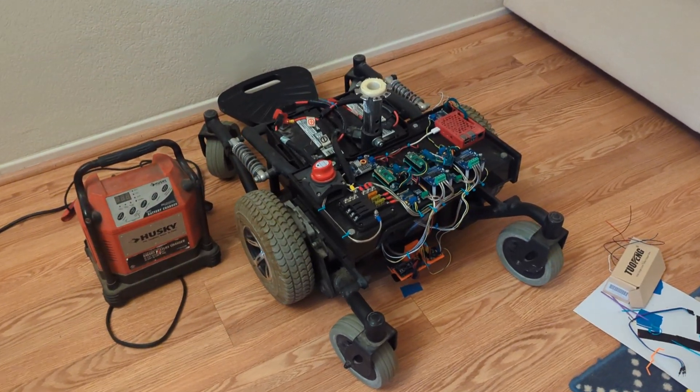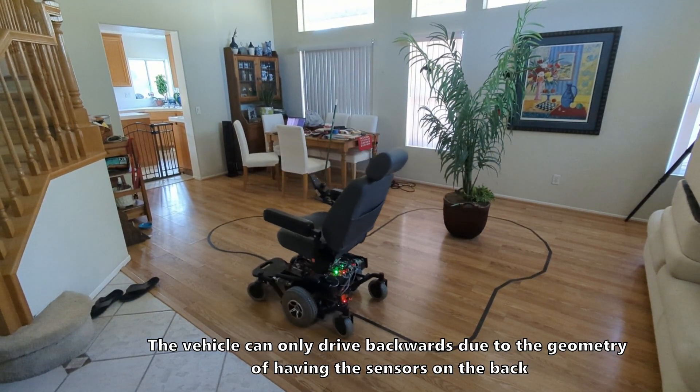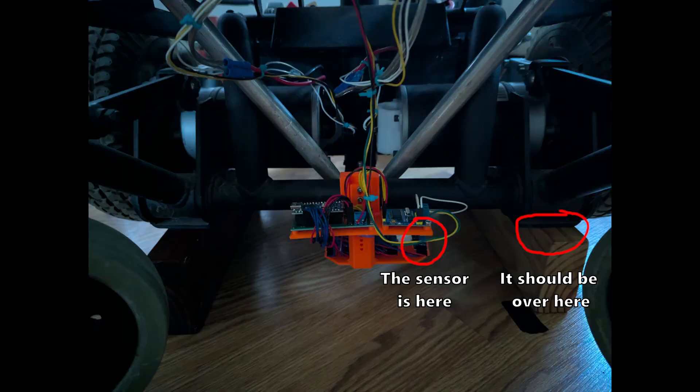The first iteration of the sensor block that I built had six sensors in a line across the back of the vehicle. Obviously, that's not the three sensors at the front I just mentioned — I built this before having the algorithm fully fleshed out, as part of figuring out how the algorithm would work. The first major flaw is that the sensors are all in the back of the vehicle, so the vehicle isn't able to drive forward with just these sensors. Additionally, for a vehicle this large and heavy, the sensors are too close together and the momentum of the vehicle means it cannot react fast enough for these minor disturbances. The final issue is that the location tracking sensor — the one that measures the tick marks — is way too close to the center of the vehicle, so it would occasionally read the main ride profile line as a tick mark because it veered too much off course. This can be fixed by moving it further to the side of the vehicle.